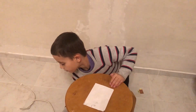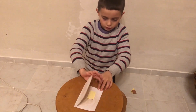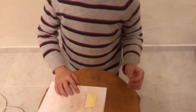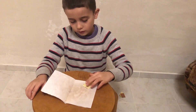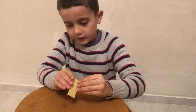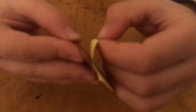Now let's open up this paper. It's very hard — the paper and the PCB are very hot right now. Let's wait some time for it to cool down. Now we can remove the paper from the PCB carefully. We want to remove the toner from the PCB.